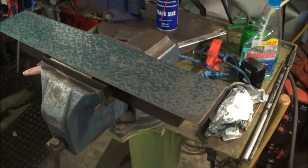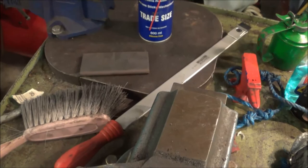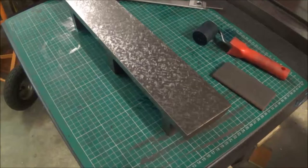I've finished rough scraping of the straight edge, and there are a few hard points in here which I've had to scrape separately — a bit annoying. It's a little bit low at this corner, so it's not quite scraped up to that point, but that will come in when we start taking some of these points down and splitting them a bit more. I'll change the scraper from carbide to a smaller radius and start working these points down.